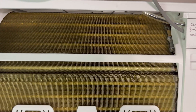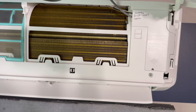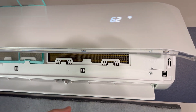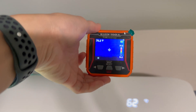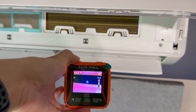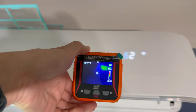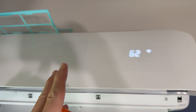Now we're back inside. And as you can see already, the defrost is already gone — no frost anywhere on the system so far. It's literally been probably two minutes since I put all the refrigerant in and came back inside. Let me grab a thermal imaging camera to see the difference coming out of here. The air coming out is about 46-56°F, and the air going in up here is closer to about 77-78°F. So we're seeing a pretty big delta there. I probably should have shown you that this was a real problem earlier — it was still cooling about 10 degrees, but nowhere nearly that effective. The only reason it cooled at all was because there was ice and the fan was blowing air over the ice.